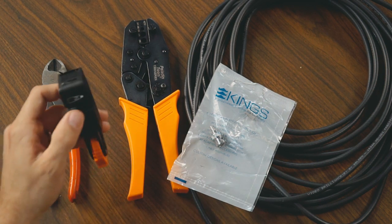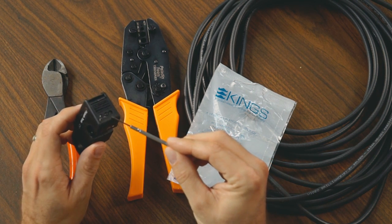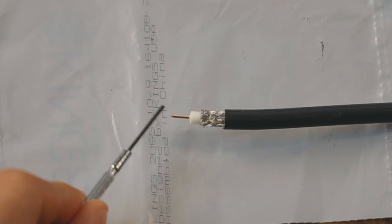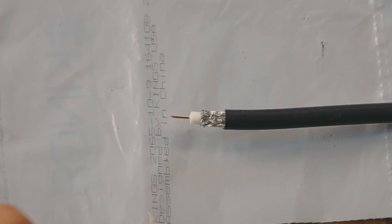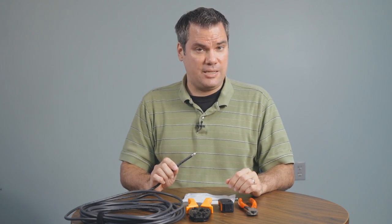The first thing you're going to need to do is get your wire strippers set up properly for the cable size. You adjust these screws, which move the cutting blades in and out to create a cut that should look like this: the center conductor fully exposed, a section of the inside insulation without the braid, and then a section of the braid. Keep adjusting it until you get it set up where it comes out nice and clean like this. It's really worth it to put the effort in and use up some cable to get this nice and clean.